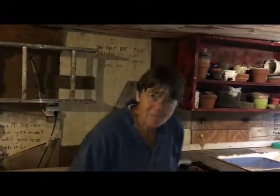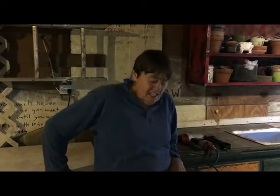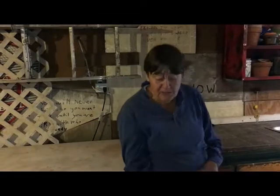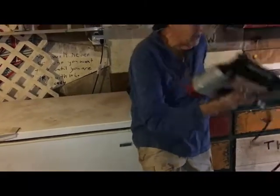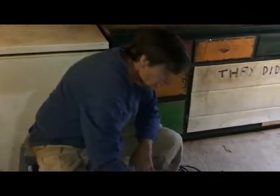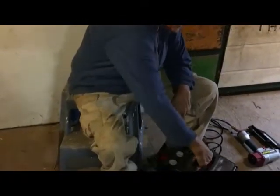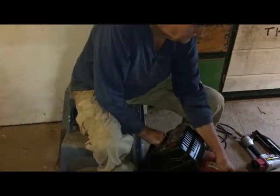I'm going to show you some stuff - because if you're like me, when you get a new tool you just kind of guess and don't read the manual because the manual just confuses you more. There were a couple of things I didn't know about this nailer when I got it. One is that every single time you use it you're supposed to disconnect it and put oil right in there - that keeps the nails sliding out easily. But the other thing I didn't know ruined my first compressor after only 10 years.